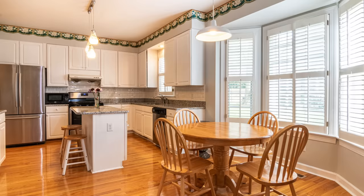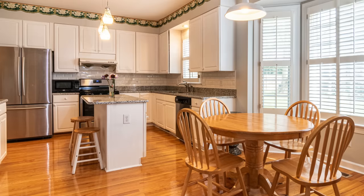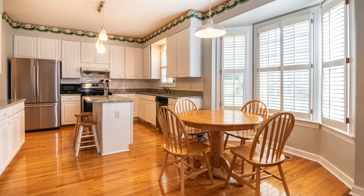I also want to point out the backsplash — the countertop splash-back piece that extends up the wall wasn't removed before the backsplash tile was installed. If you're adding a backsplash, remove that piece first; a little drywall damage doesn't matter if you're tiling over it anyway. I'd update the faucet here too — getting rid of the separate spray and using a button for the garbage disposal to fill that hole. I'd keep the granite since it actually looks great.